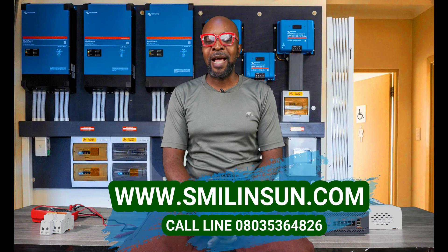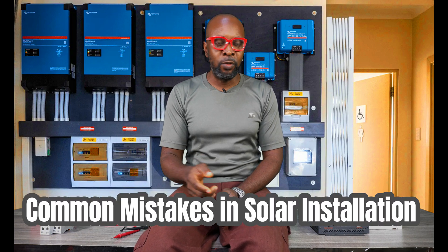The way you configure your PV is also important — wrong PV configuration should not happen. Your system will determine how you connect your solar panels — whether one in series, two in series, three in series, or more. For example, if you're using a PWM charge controller, it does not have the ability to convert voltage back to current. So if your system is a 12-volt system, it limits you to around a 100-watt solar panel. Too much voltage above the headroom for your nominal voltage will be wasted because PWM cannot convert it back to current.